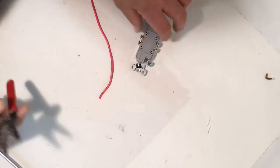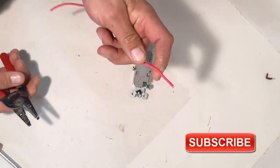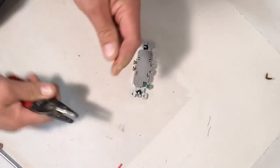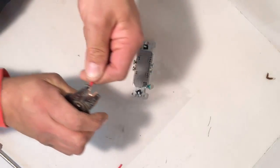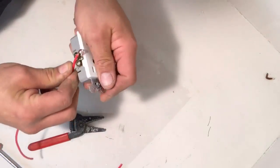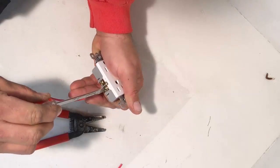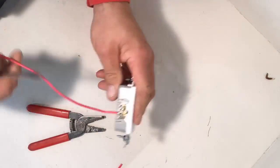Like I said in the beginning, the most common wire you're going to have in your home is a solid piece of copper wire. Basically you just strip the end, make a loop on the end, and install it. Tighten your screw, and that's installed.